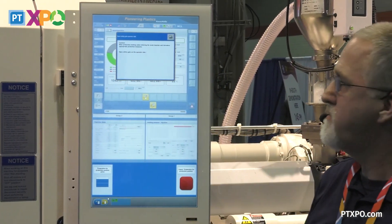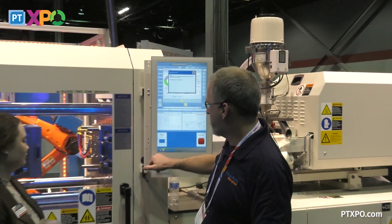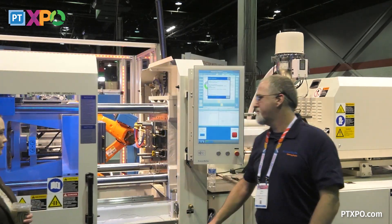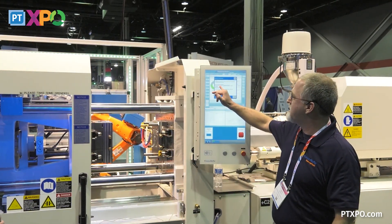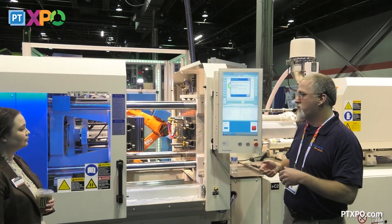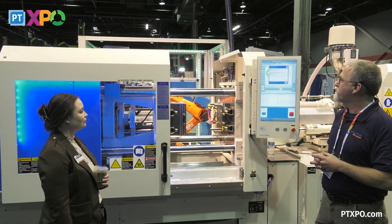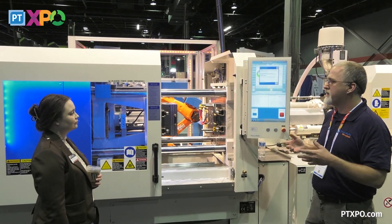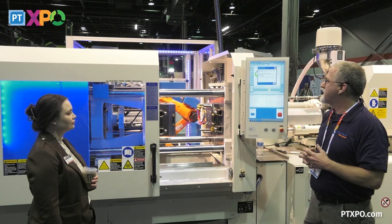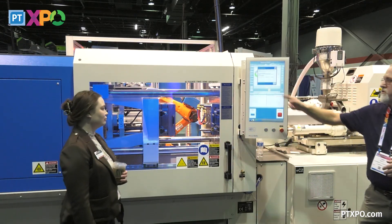Caution — it tells you to open the safety gate. On this particular machine, you have to unlock the gate and then open it. It says: enter the mold chamber, remove any components or sprue. If there are parts or runners in the mold, remove them. Check the ejector pins for contamination — clean or lubricate if needed. Then exit the mold chamber, close the door, and hit OK.